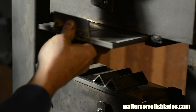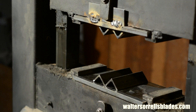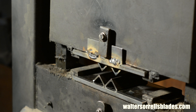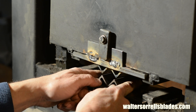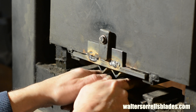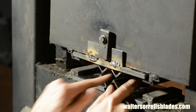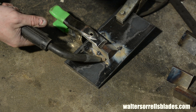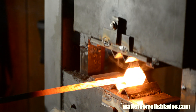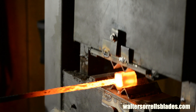Once that's done, I'll install the first completed die in the top position on the forge. Next, I'll set the other two pieces of angle iron on the bottom plate, bring the top die down so they're almost touching, and adjust them so they mate perfectly. The closer they mate, the more trouble-free the operation of the die. Then I'll use welding clamps to clamp the two pieces of angle iron down, take them back to my welding station — that's a pretentious way of describing the floor of my shop — and weld them up. Here's a little footage of the dies at work. One-inch dies are pretty darn small, so this is only useful for fairly small projects.